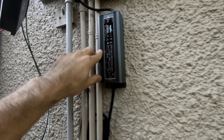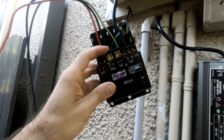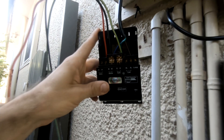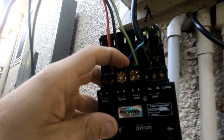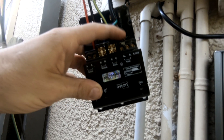This is where the low voltage cable from the garden comes back - it's just soldered and taped into the driver slash transformer. What we're going to do is tidy this up, run it up into the back of the panel, and chuck it behind the panel for now as a bit of a test run. We'll have to upgrade this switchboard at some point in the future because it's an absolute mess, but this is what the basic wiring looks like - active and neutral coming in, the neutral going out to the driver slash transformer, earths joined, and the active going out to the transformer as well.